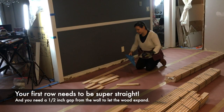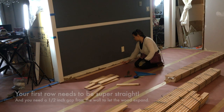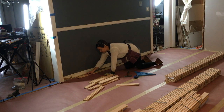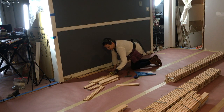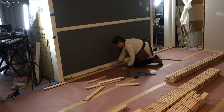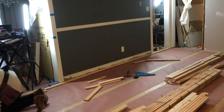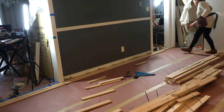I need to figure out exactly where to start my flooring. It needs to be very straight and at least half an inch away from the wall, because you need to allow for the flooring to expand and contract — you cannot put it right against the wall, and that's what your baseboard is for. Some pieces, particularly the longer ones, come a little bent or crooked. I suggest you either discard them or leave them to be cut at the ends of your flooring, because it will be very hard to put them in place with the nailer.